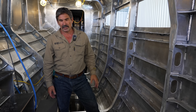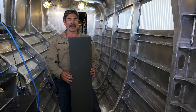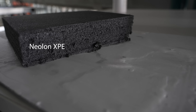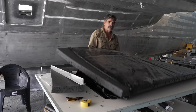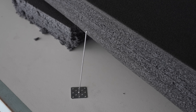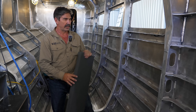The second option is using an insulation bat. This particular one is called Nealon — I think it's an extruded polyethylene foam. It's actually used as both a buoyancy and an insulation foam. It's incredibly light, about 25 kilos per cubic meter in density. It's a closed-cell foam so it doesn't absorb water, moisture, or smells, and it makes pretty good thermal and sound insulation.